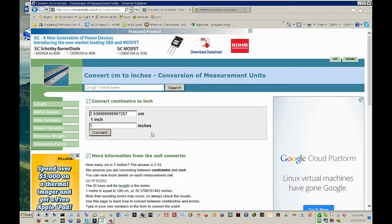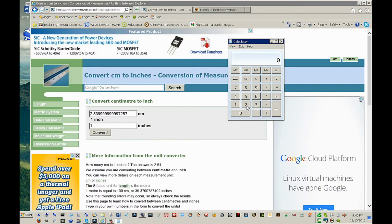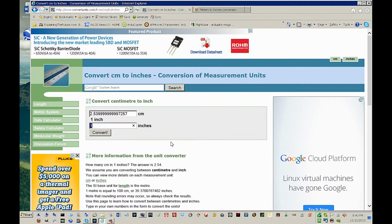So at 20 feet, which is 20 times 12, must be 240 inches, 609 centimeters. Yeah, that's going to be close enough inside the sensor range to me to start playing with it. I may lower it a little bit due to the fact that if it's windy, the wind could blow the ultrasonics off course. So I think I got it. I'm going to start with somewhere between 16 and 20 feet. Tell you the truth, the default sets it at 60%, which is 16 feet. Later.